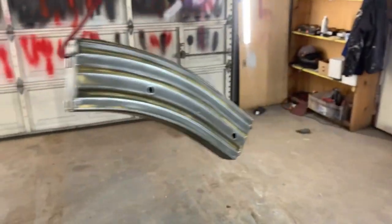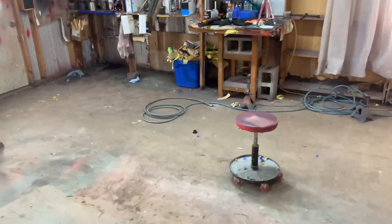These we're gonna go ahead and prime. That we're gonna go ahead and prime. We're just gonna do a light little coat of primer. This will prime it because it's metal. Anything metal, if it's showing bare metal, you wanna go ahead and prime it.